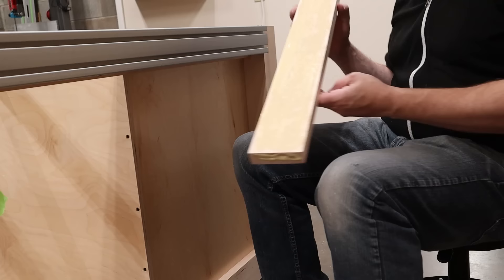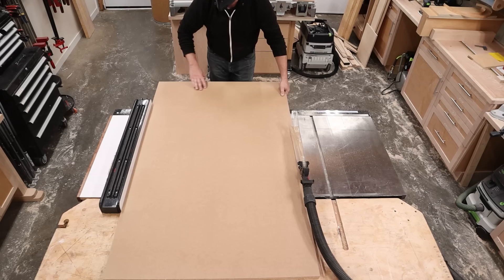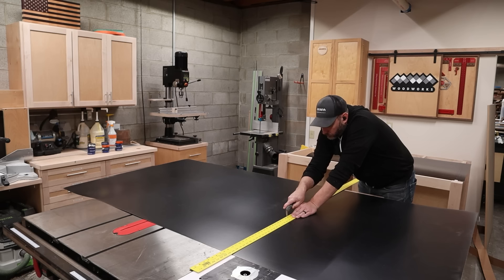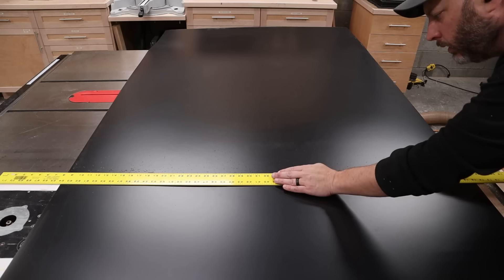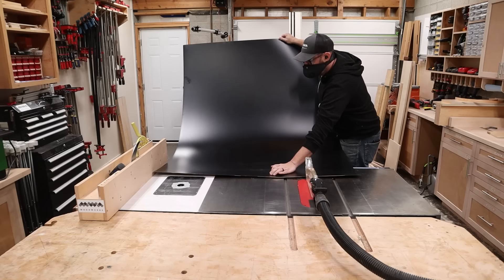The final little bit of detail to add to the base was to cover the exposed plywood edges with a piece of trim — just glued in place and clamped with painter's tape. With the base finished, I can focus on the top, which I'm making out of MDF. I don't want anything complicated like a torsion box, and I don't think it needs to be real thick because I have all those thick supports built into the frame of the table. But to really make the top pop, I'm going to laminate it with this sheet of black Formica. Formica is used every day to make kitchen countertops and it's pretty durable and wear-resistant. Wood glue won't stick to it, and with it being black, stains and other blemishes are going to be harder to see. You can get this stuff in lots of different places — I like to get mine from my local plywood dealer, but you can also order it online through your local Lowe's or Home Depot. It's easy to cut with this special scoring tool that kind of looks like a sawtooth welded to the end of a hook knife. Once you score it, it snaps pretty easily right on the score line. And if you're brave enough, you can even cut it on your table saw, which I don't really recommend — it's kind of like trying to cut a giant flour tortilla on your table saw.